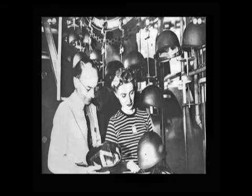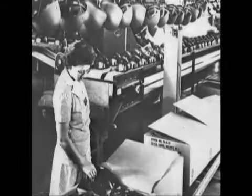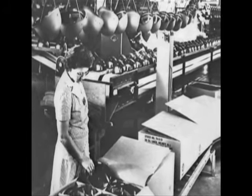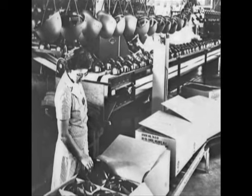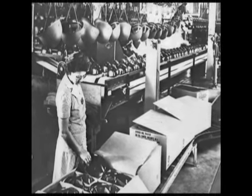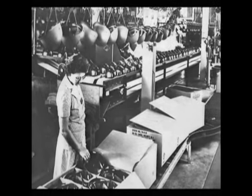Once the helmet completed curing, the liners were then inspected for quality control. Finally, the completed liners were packaged for domestic shipping. Complete with suspensions and chin straps, they were packed in nested stacks of 5 liners separated by paper. 30 liners were shipped in each box to be matched up with steel helmet shells.